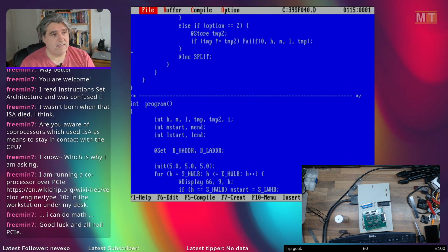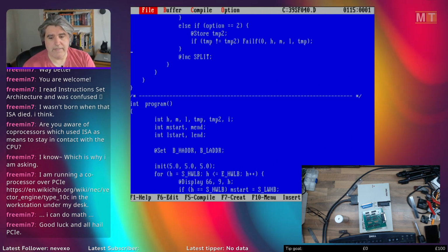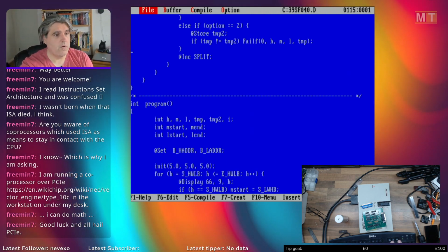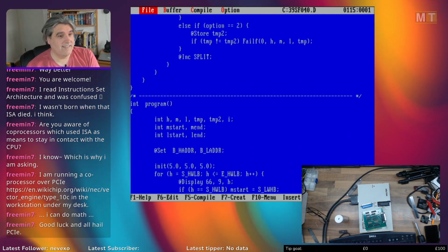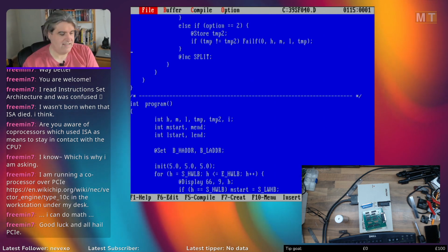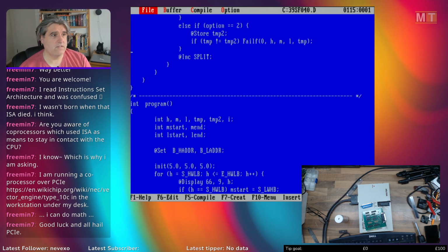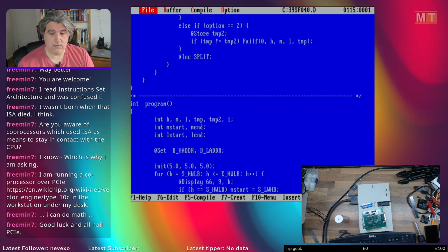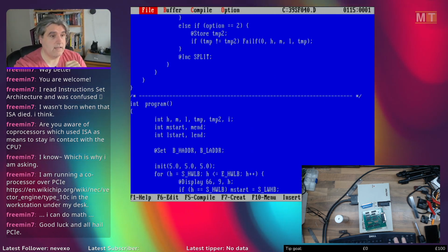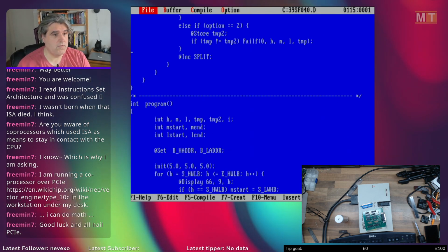So the card and the cable are almost just an extension of the ISA slot, and everything that's in the programmer is an ISA card with all the devices in it just coupled straight onto the bus. So the software is not talking to the card. The software is talking to the I/O chips that are in the SuperPro programmer. The card just moves the chips into an external box.